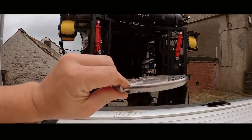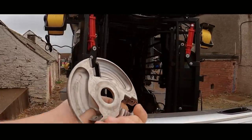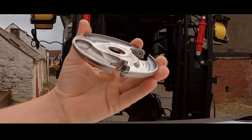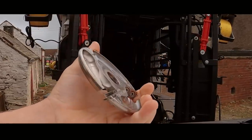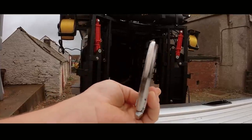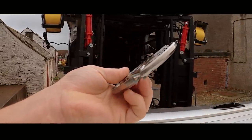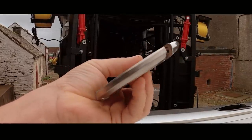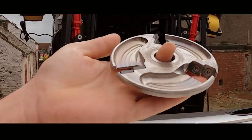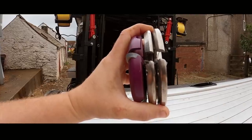And then if we look at the Trimtec Titan — this is the one with LX and Rim Cut — you can see those blades stick down just that little bit more and the corner of the blades are more exposed. This disc also has cutouts on the back to throw away the fragments of horn. And then if we look at the traditional Titan disc, you can clearly see the edge of it is much thicker, which means less of that blade is actually protruding out of the side of the disc, so you can't really cut with the edge — hence the term Rim Cut for the other disc. This disc looks very similar to the Rim Cut one but actually performs very differently.